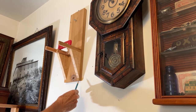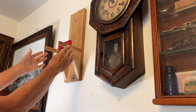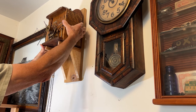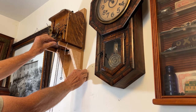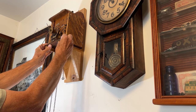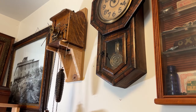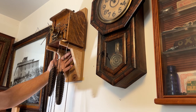Get the perch level. It helps to mark the wall, or if it's mounted permanently, to put a fastener in the bottom. The bottom of the frame on this one is twisted from the heavy weights — a shim will fix that. Some of these don't have a pendulum leader, and on those the pendulum rod attaches at the top on the pendulum leader hanger. Having a pendulum leader makes it easier and quicker to remove the pendulum rod.